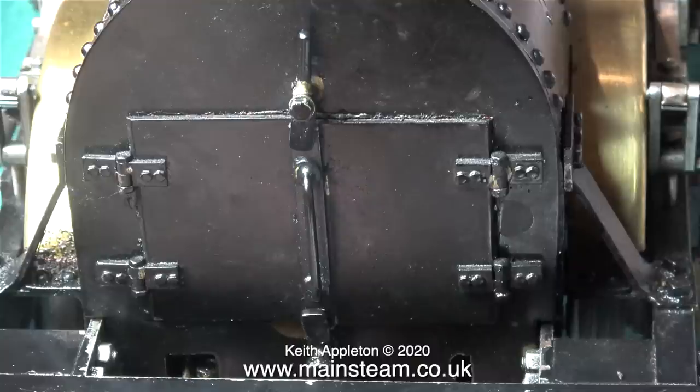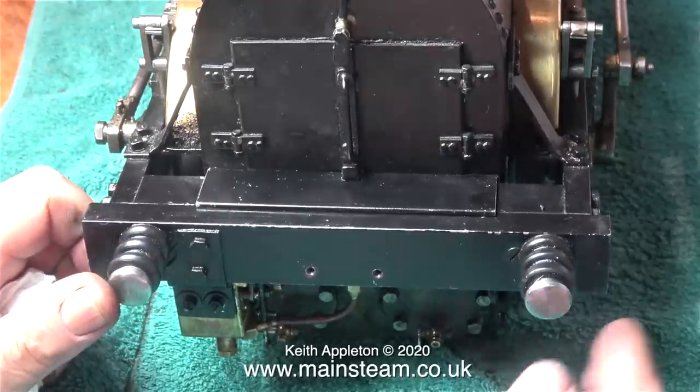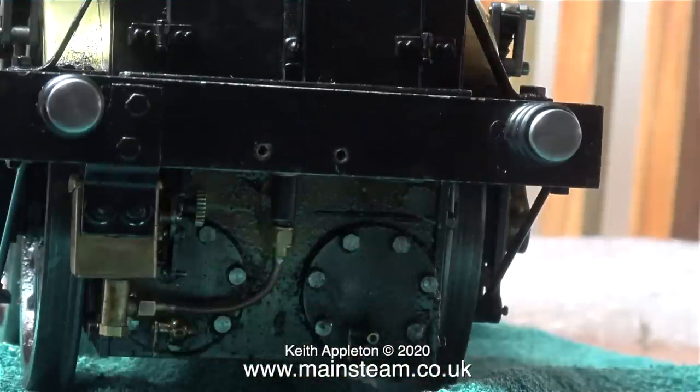Most of the things I've seen on this locomotive are very well made and the overall design and functionality is excellent. Look at the way this small strip fits at the front to cover the access gap where you get to the lower smoke box door latch. Even though this is a diversion away from the original design, I particularly like the sprung buffers. I'll fit some sort of coupling to the front when I get round to it. Note the two small drain cocks in the bottom part of the cylinder — manually and externally operated, no lever in the cab. I think I'll change these locomotive type drain cocks for some nice ornate brass ones with handles. Under the front is also a small mechanical lubricator in a place where it's easy to get to and easy to service.